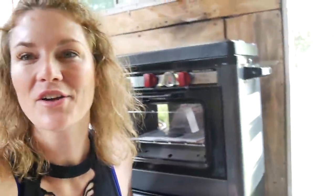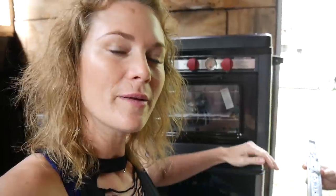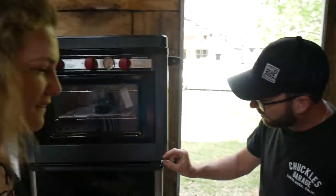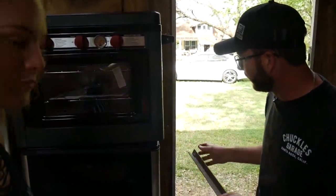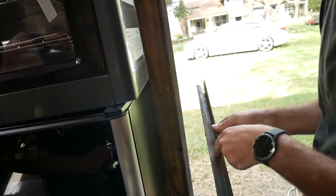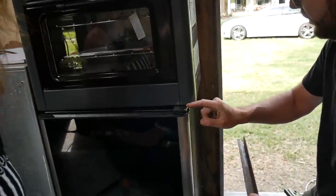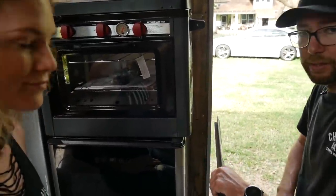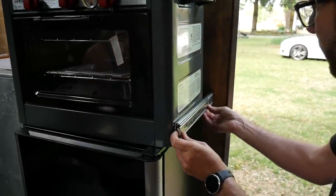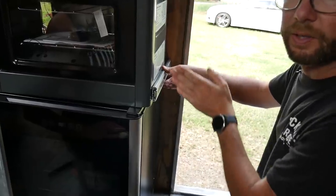We want to be able to pull the Camp Chef oven in and out of our kitchen enclosure because it's going to be so great for camping. When the weather's nice, go cook outside, take it on the boat, take it different places — so we didn't want to secure it permanently. Aaron thought of using drawer tracks to be able to pull it out and then lift it up and out of the kitchen. Because we don't want a big gap, we're going to use angle iron — that was Emily's idea — and then in the back we'll go across with the frame and on the bottom we'll put a plate. That way you really don't see much more than maybe a sixteenth or an eighth inch gap, and if we cut these at 16 inches with the 16-inch tracks, that'll put us right about where we want to be. Then we can build a face on this like the front of the cabinet.